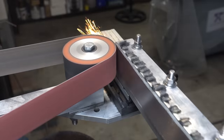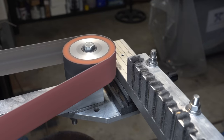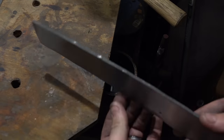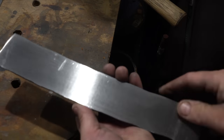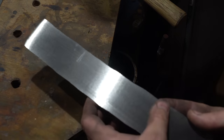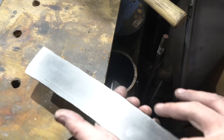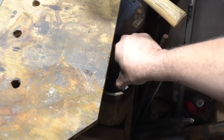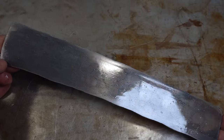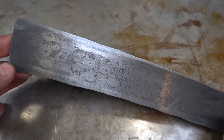Now I'm moving on to a 120-grit belt just to get a nicer finish. I end up using a 600-grit belt later to get an even nicer finish before the etch. We've surface ground this to 120 — you can see there's still a little mark here and another one on this side, but there's just no point grinding all the way down. Whoever puts the knife on it will just go around that or it'll come out on the bevel. I had to go back and regrind it to 600 grit so the pattern showed up a little better — and there you see it.